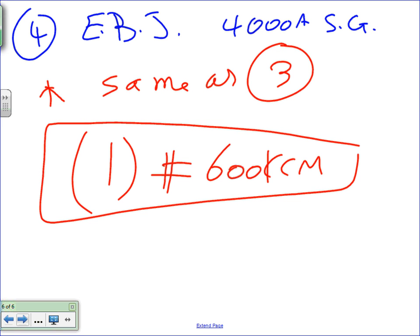That's being bonded to the conduit? That's bonding the conduit, if they are metallic. If they're PVC, do you have number four? No. If you're coming with PVC from underground to an open switch gear, no need for it. If you're coming with EMT, you're going to tie it. Rigid, you're going to tie it. Flex, you're going to tie it.